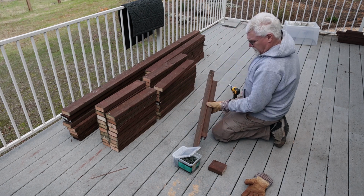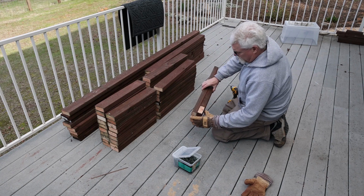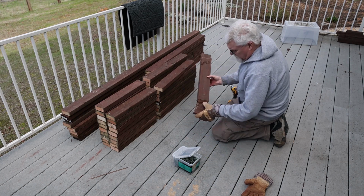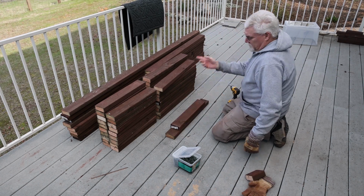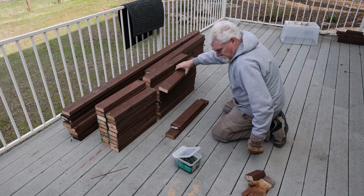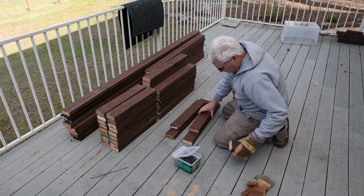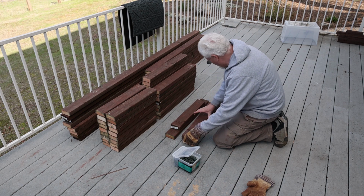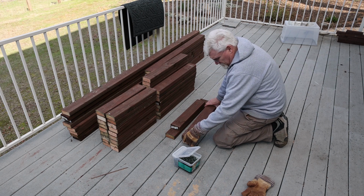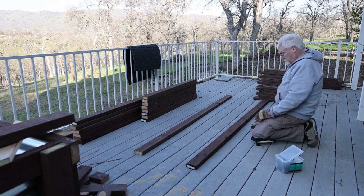And what you're building is those. They are a 2x4 wide at the ends and 27 inches tall. You're going to build 10 of them for each bed. Again, pretty simple. So step 1 was making all the cuts. Step 2 was building these things, these vertical supports.